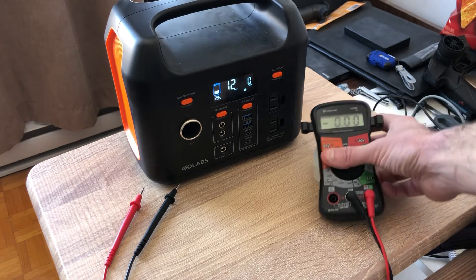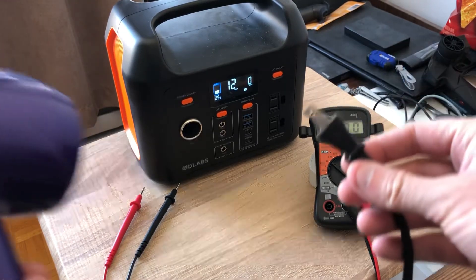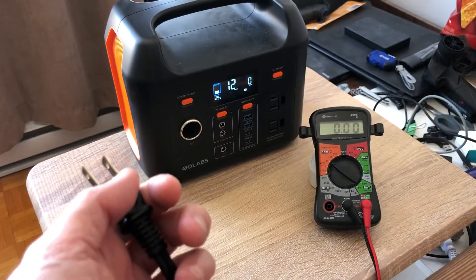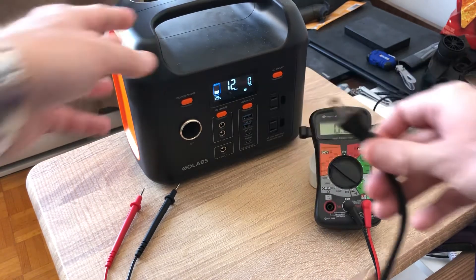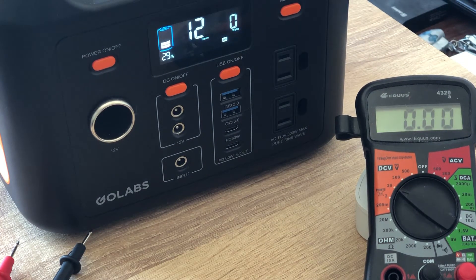I've got my multimeter right here so you guys can see that. I have a hairdryer on the fan setting only — when I plug this in it's going to start, because I can't run it through the heating element otherwise it's gonna overload. I'm just gonna place that on the side and run the test. I won't talk much because this is gonna produce a lot of noise. The battery is at 29% right now — it shows 12 hours but that's irrelevant because it readjusts itself as soon as there's a load on, to give you current estimates on how much time you have remaining powering that item.